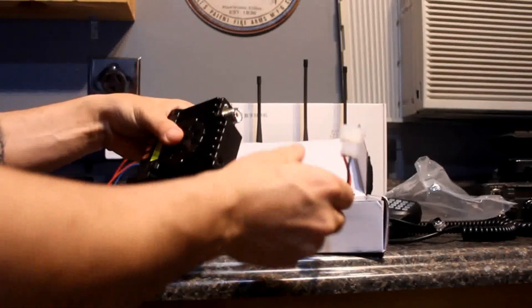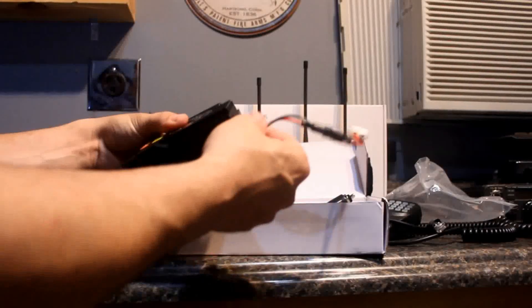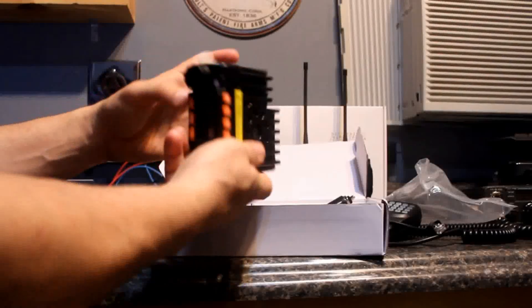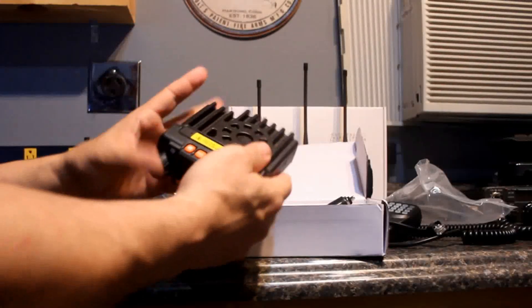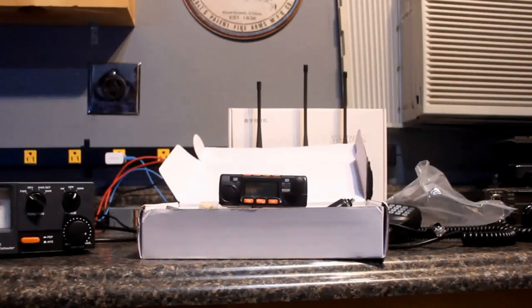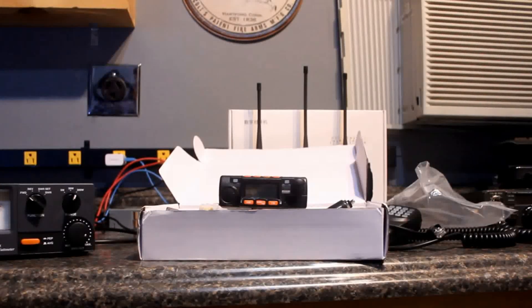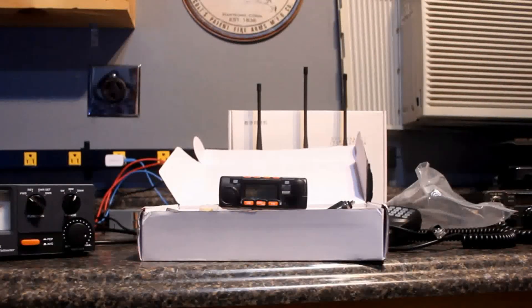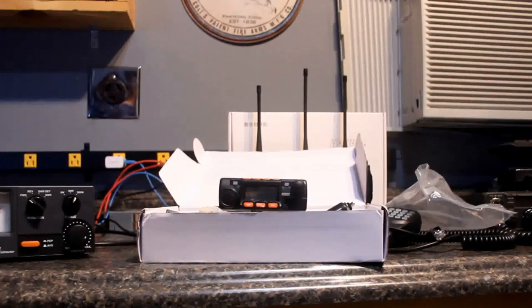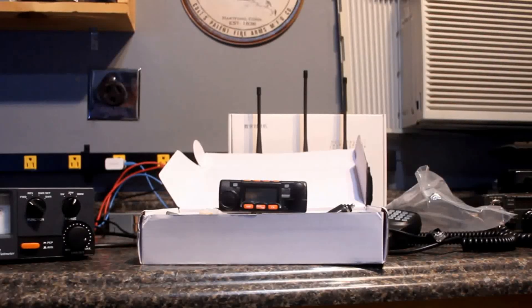The line coming out of the back has an inline fuse on the positive side and the standard T-connector, but this thin wire is still present. I'd question whether that wiring would last, depending on usage. If you're one of these long talkers that ties up repeaters a lot, or if you have really long FM simplex conversations, you might burn up that wire — you never can tell.